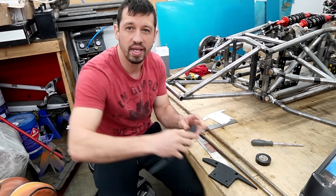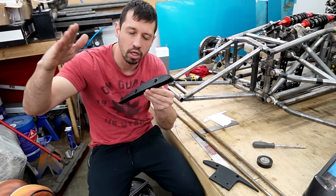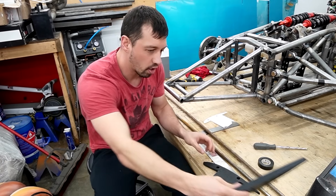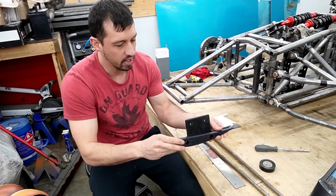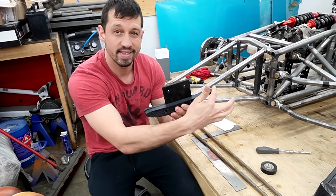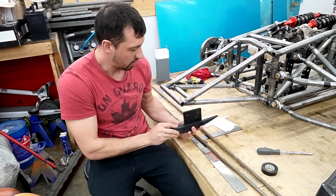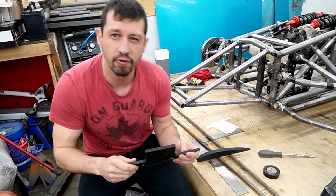I 3D printed this piece - this is PPA carbon fiber, it's relatively strong. You can see it matches our airfoil profile and has a little vertical riser. The original plan is something like this, but I cut it in half because I want it to bolt together to make two pieces of the wing. A metal piece gets welded to the two bars at the top, and then we can bolt the bottom piece on. Then the two rods run the length of the wing, and airfoil pieces about 200 to 250 mm long just slide over the end pieces. This one warped a little bit, so I still have to figure out my ASA filament settings.